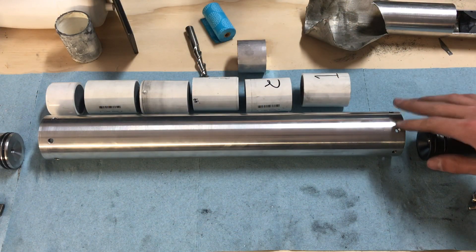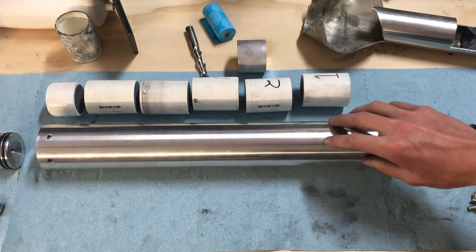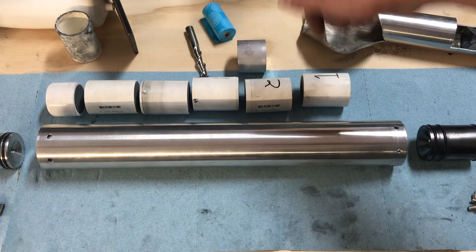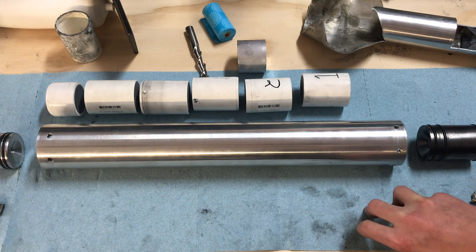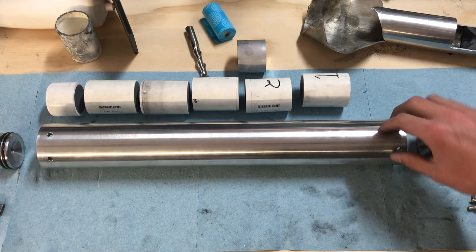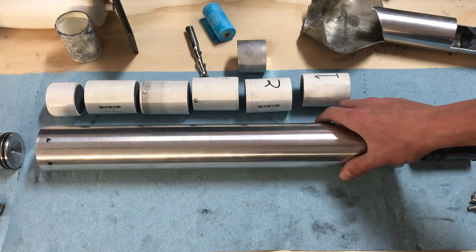Let's start off here with the casing. This new casing is quite a bit bigger than the old one — 18 inches long versus the old 12 inches, quite the size upgrade. With all 5.5 fuel grains crammed in it, that gets us to the equivalent of a K973, which has about 2,238 newton seconds of total impulse. Obviously it's a lot bigger motor than the old one.